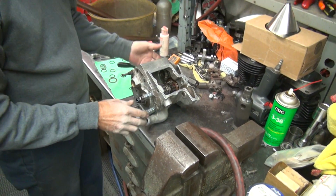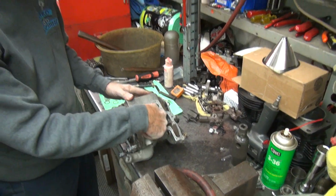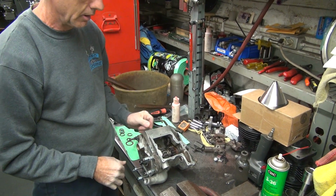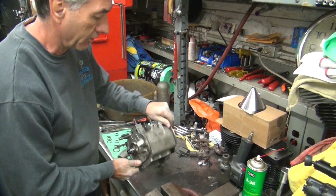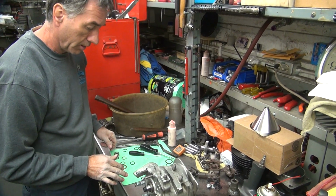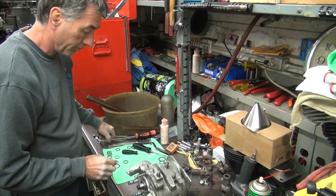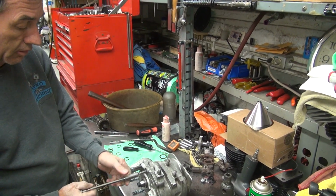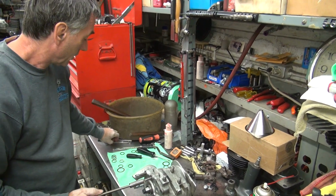But I didn't put the right washer in there, so I'm going to put 5 back in this one. I'm going to take 2 or 3 out of the other one, and we'll check it again. And that should put it pretty close to what we want. As long as I don't lock up second gear, I'll be happy. Second gear feels like it's a lot looser than the 10 thou I was figuring it was going to be, for whatever reason.